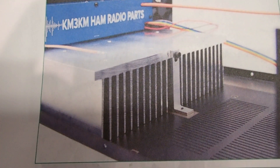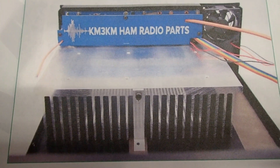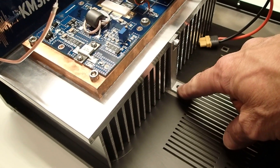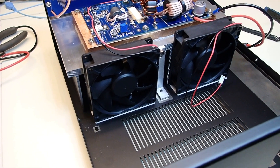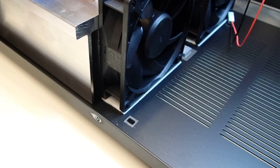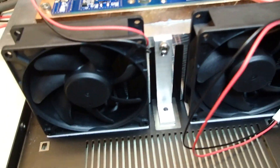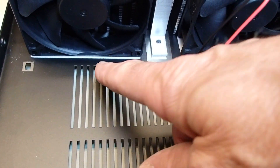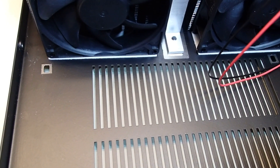The next step is to install the power unit assembly, held in place with three cap screws — one from the bottom and two from the back. The fans are installed; you can see the hub clearly from the back. The arrows on the side of the fans show airflow direction — air comes in and blows through the heat sinks to the back of the case. I cleaned the bottom of the case with isopropyl where the adhesive strip goes, on both sides, cleaned off the anodizing, and let it dry for a couple of minutes. Then peel the backing off the strip and push the fan down.